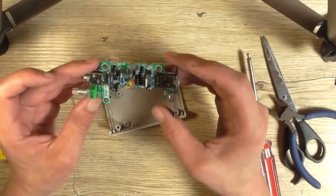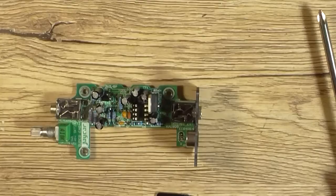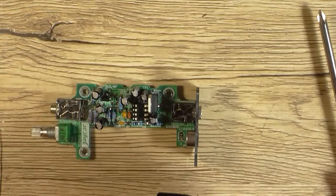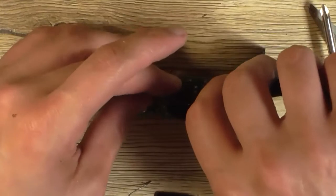So now I need to figure out what frequencies I really want to switch in there, if any. Okay, just for shits and giggles, I'm going to go for 180 picofarad for the 9 kilohertz plus 3 dB and a 4N7 for the 370 hertz. So the C3 and C4 respectively. There's the 4N7, which is a 472, so they're in.